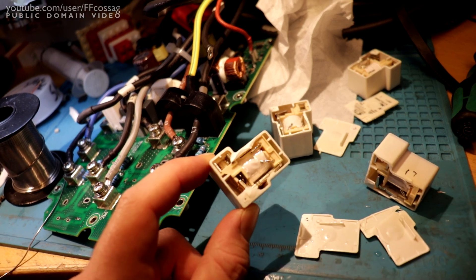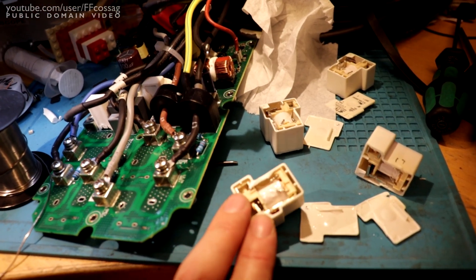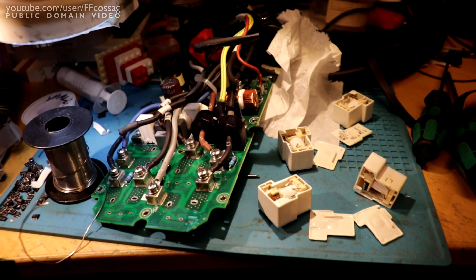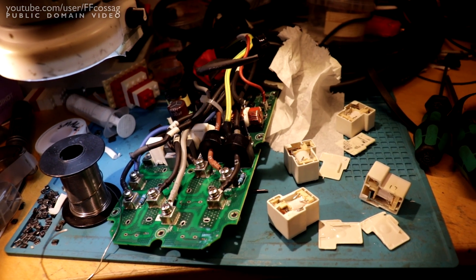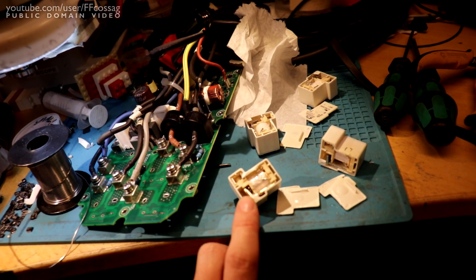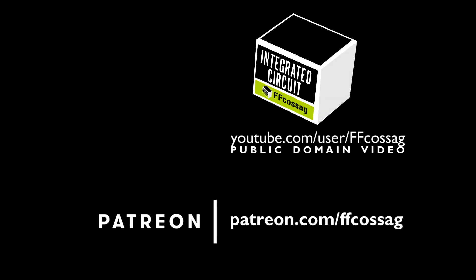At least now we know why this thing was putting out voltage. I'm probably going to maybe replace the relays if economical, or maybe just scrap it and save it for a tester unit. At the rate at which these seem to be failing, it could be useful to have a tester unit lying around for cross-checking. Otherwise this thing isn't that broken - it does operate. Confirmed diagnosis: it's full of water.